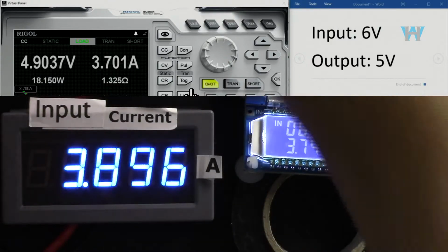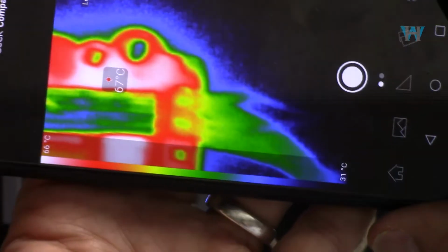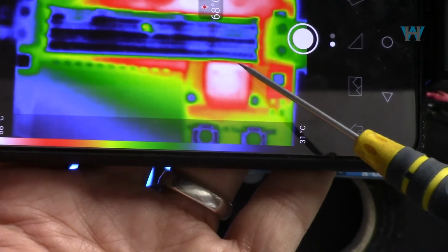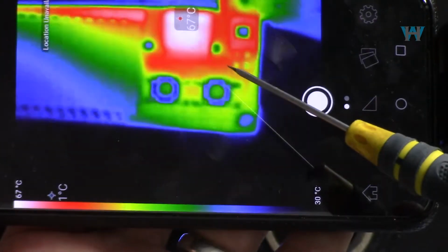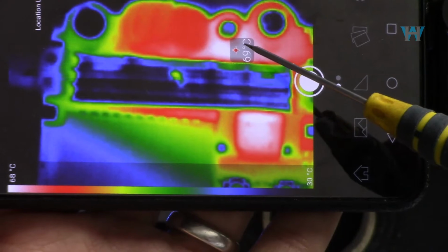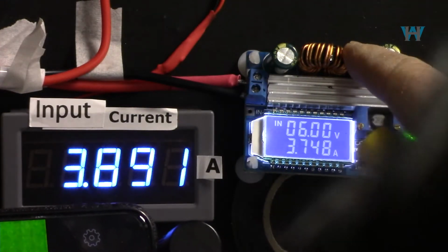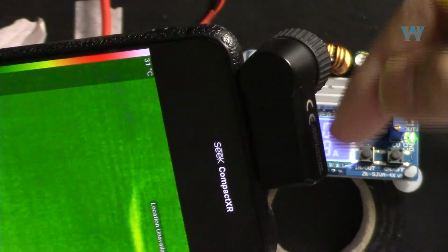The module is getting hotter. Let me show you the thermal image of the module. As you can see, the heatsink is the coolest part, and on the right side is the hottest spot, 68 degrees Celsius. It's very cool, and this side is hot, and the other side is 69 degrees Celsius. At this point, this capacitor is 69 degrees. I'm using this thermal camera. The link for this will be below the video in the description.